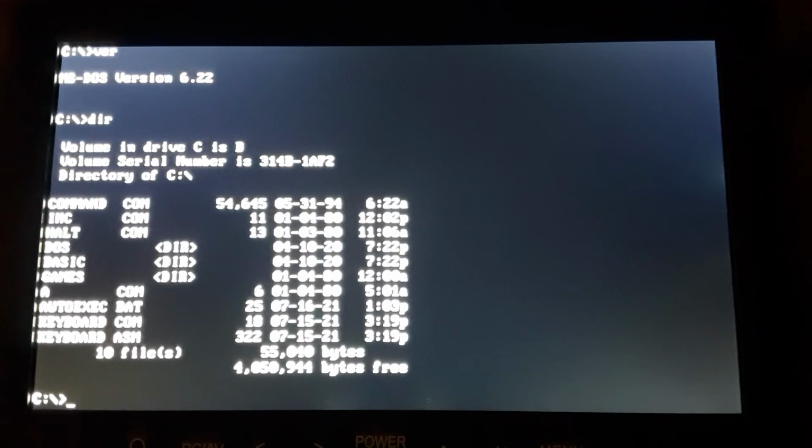So I've tested it with all the files, and not everything works as well as on the V40 board that I made. But quite a few things still work. Like I say, there are some issues with this. I've got to figure out why the CGA card won't work. VGA probably works because it's got its own clock, where the CGA uses the system clock. So there may be some issues with that. And then I've got to figure out what's going on with the speaker.